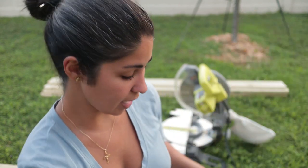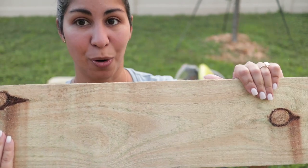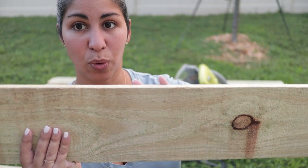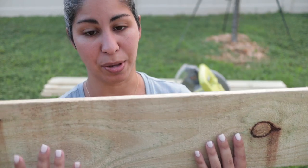I'm going to cut these down to 11 inches because the width of these fence boards is five and a half inches each, and there will be two of them stacked right on top of each other. The corner post will hold them both in place, so I'll cut down my corner posts to 11 inches and then go from there cutting down the rest of my fence boards.